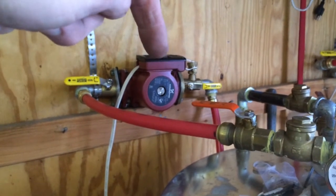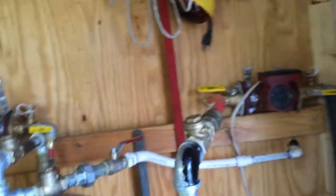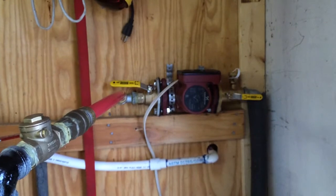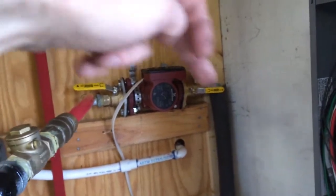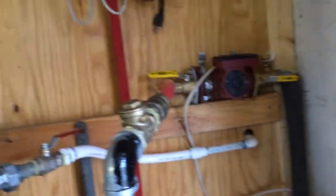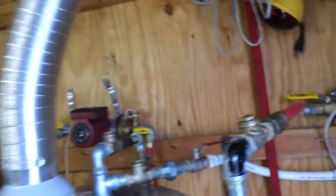This is a high spot in the heat exchanger system, so there's a little bleeder valve right there — same thing on the other circuit. When I first fired these up, I hooked a garden hose to the bleeder, which is garden hose thread, and fed water in to make sure everything was full before turning the pumps on. That was pretty handy.